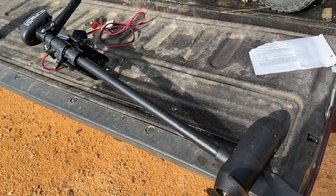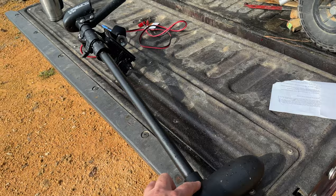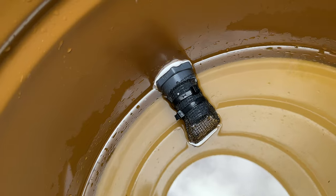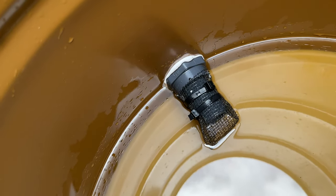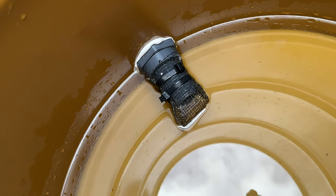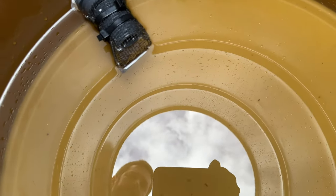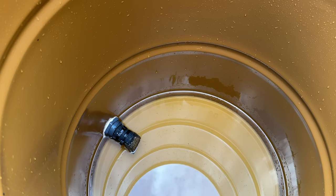I've been using it a year or two now, and it does get dried sugar in the propeller and it'll stick, but I just free that up before I use it every time. I look at this as a disposable item and something I can upgrade to a dedicated syrup mixing system. In the bottom of the tank, I mounted a through-wall bulkhead fitting — it's polymer, I got that at McMaster-Carr. I made a basket out of eighth-inch hardware cloth and put that over the outlet with zip ties. Anything heavy sinks to the bottom and the pump won't pick it up, and anything that floats can't go through that mesh, so it keeps my pump clean.